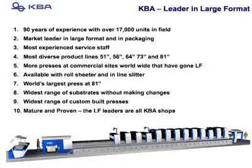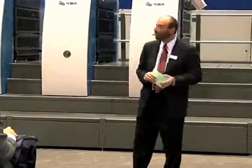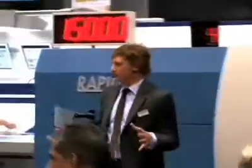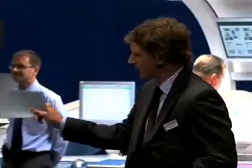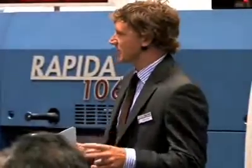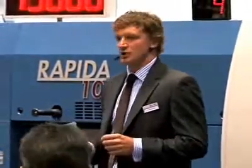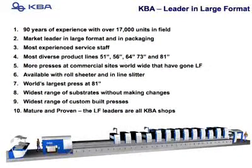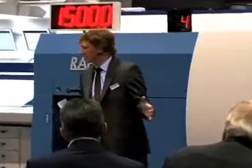KBA is also proud of having the longest sheet-fed press in the world, running right in the northeast. It's a 56-inch press — a huge press. Starting at the feeder, there are two printing units, then a dedicated drying unit — a stub unit — to ensure ink is 100% cured before proceeding to the following seven printing units, then a coating unit, a dryer, another coating unit, a 12-foot extended delivery, and finally the sheet gets to rest in the delivery.